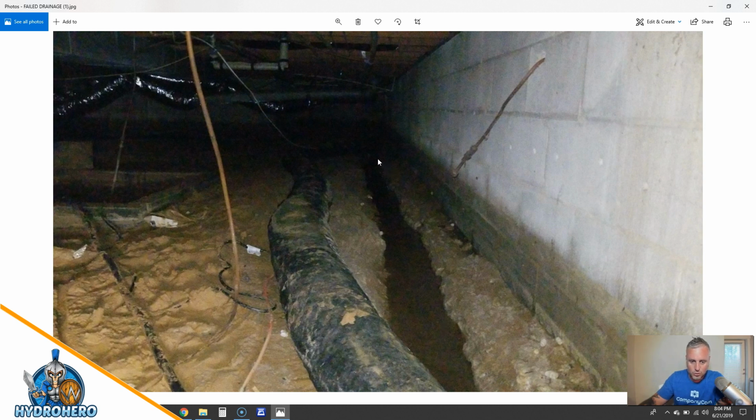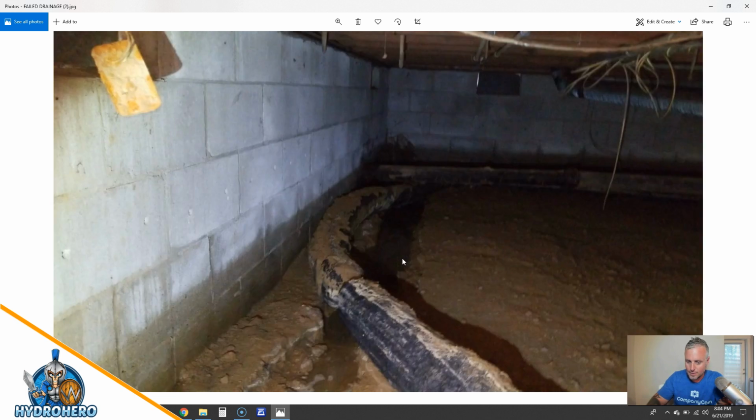This was installed the same way around the perimeter, but because the aggregate here is lighter than the water, it's totally buoyant. And what has happened is, after the sump pump stopped working, this was just allowed to be buoyant, and it turned around and just pushed right up and popped out. And this is all water that's in here right now. So here it is again. It's pushed up the NDS EasyFlow right up out of the ground.